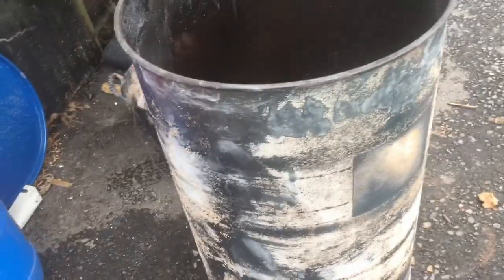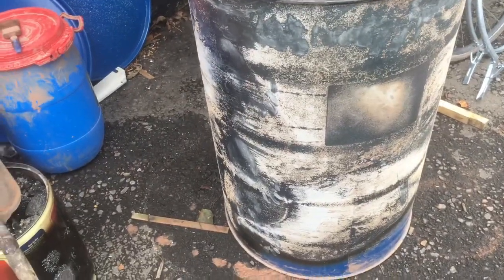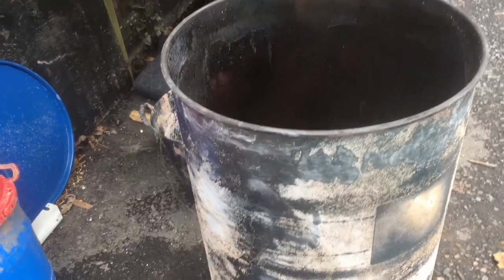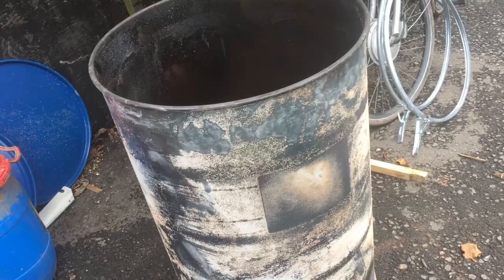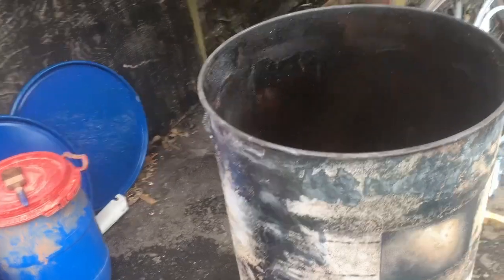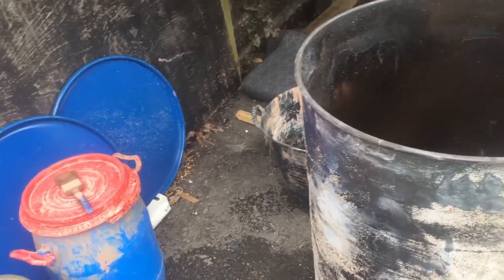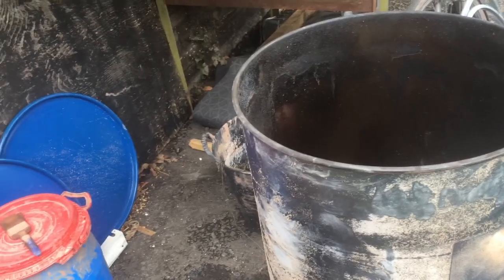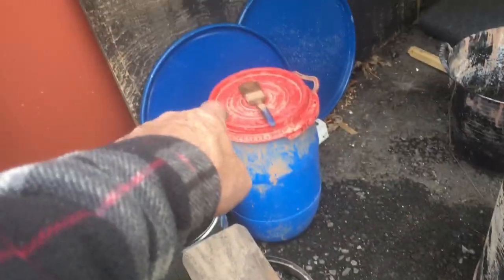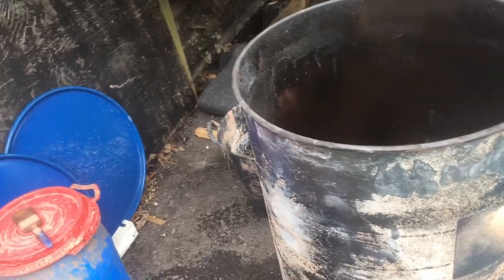The clay slip papier-mâché definitely works. I would recommend, if you can, at least 10 layers of paper, and ideally a day to dry before you burn. But I am in a hurry, I was impatient. I slapped on 3 layers of paper with very wet slip and set the fire immediately.